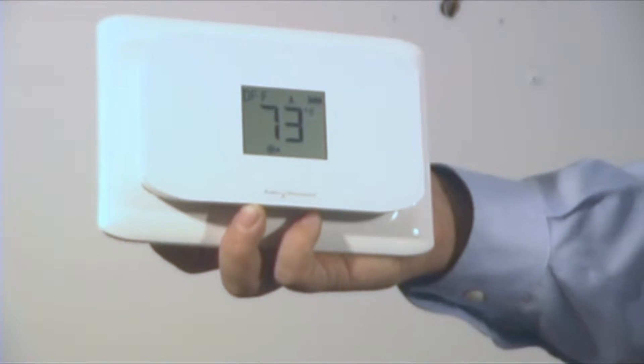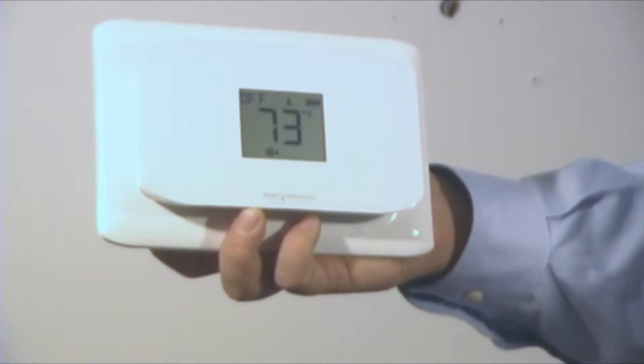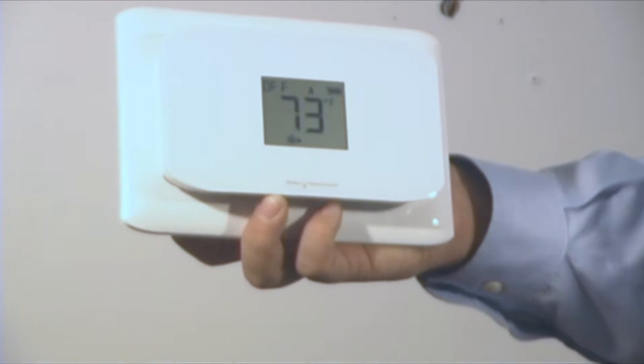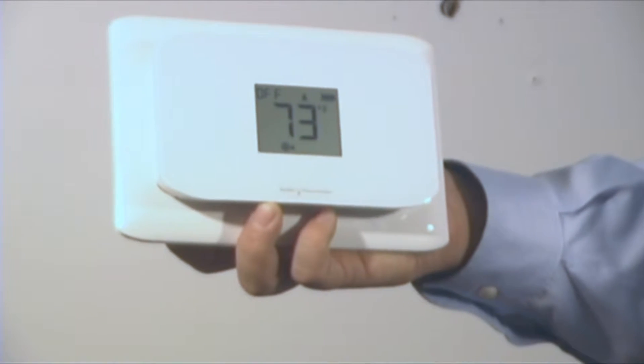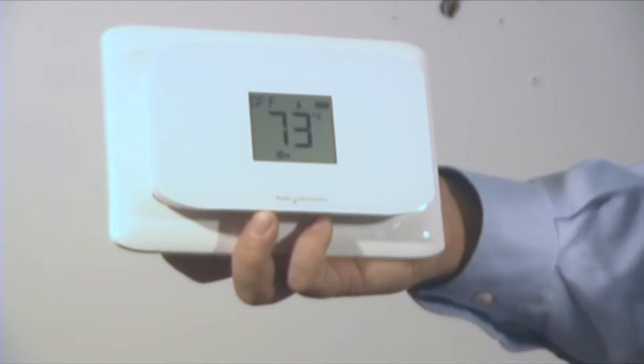This will connect to your home automation and your alarm system. It is also two-stage heat and two-stage cool compatible. It will work with your heat pump, your zone baffle system, your hot water system — just about any system you have except for high voltage.